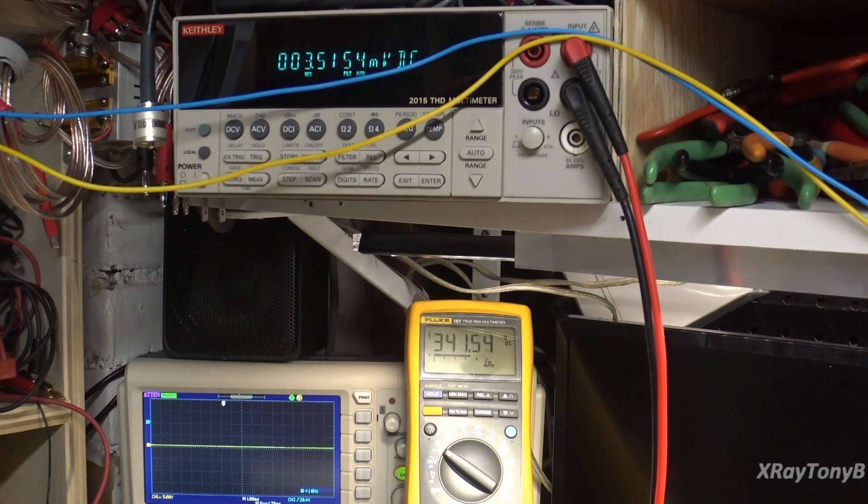That's the wrong direction, let me go the other way. I'm not going to come all the way up because I still have the dim bulb in here. I'm only going to go to about 20 millivolts — you can see it's working pretty well. Moving to the other tube: the bias is within two millivolts of the first tube, so they're within two milliamps of one another. That also makes sense because when I measured these resistors with a four-wire measurement, one was spot-on one ohm and the other was 0.99 ohm.